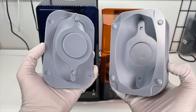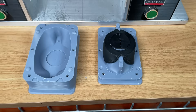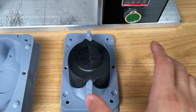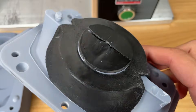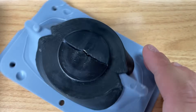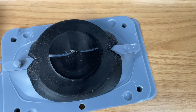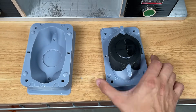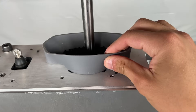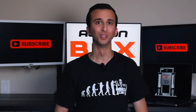Lastly, to test our mold size limit, we printed molds used to make the hoppers for Injecto 2.0. When we opened the molds, the injection was consistently too short, and the part was stuck so well onto the mold that it cracked instead of popping off when we tried to remove it. We probably needed an ejector pin on each side, just like the Lego molds. Regardless, it doesn't seem like we can inject objects as thin and large as these plastic pellet hoppers. Make sure to subscribe — we'll see you next time.